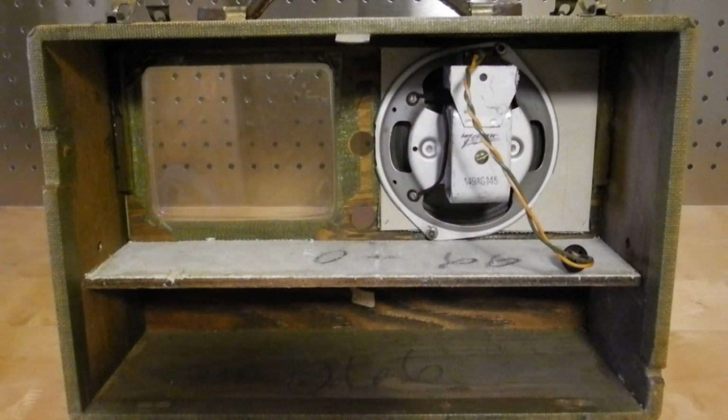As some resistors under the chassis get quite warm during operation, this prevented overheating of the wooden case that it sits on. Asbestos is a carcinogen, but should generally be safe if it's not flaking loose material and you leave it alone. I wore a mask when I dusted out the chassis using a brush.